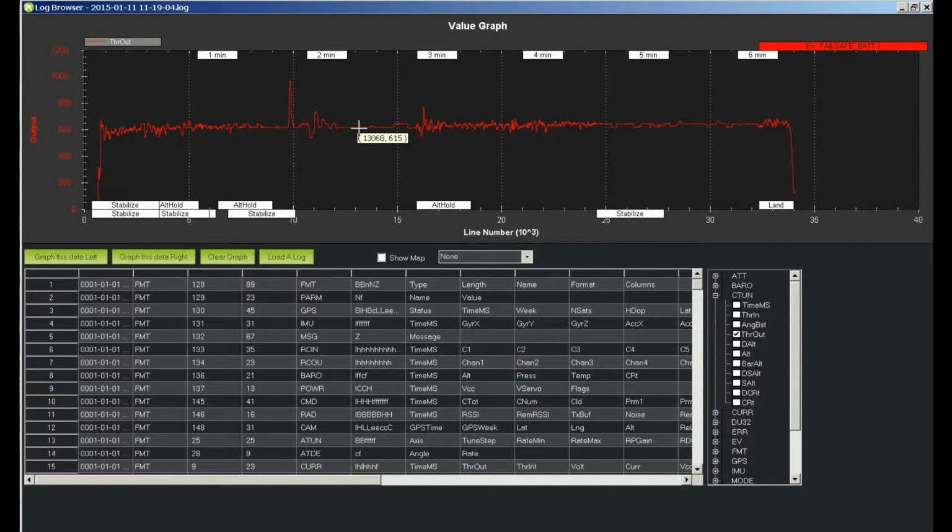But the whole thing is any time you get in trouble, you're flying along in any mode except for stabilized, you have your barometer doing something. You go into loiter mode, auto mode, learning mode, all sorts of modes. You have your GPS affecting the platform. Although you saw me in loiter mode nudging the platform around, you can do that. I have that set to do that. That's another parameter. You can tell it, no, I don't want to be able to nudge it around in loiter mode. I do. I want to be able to nudge it up and down.